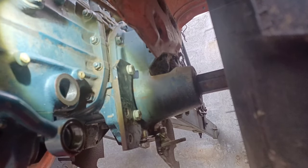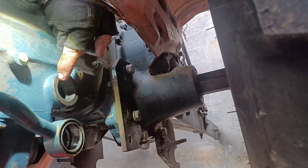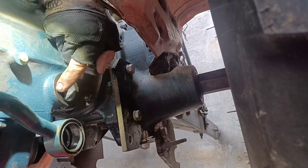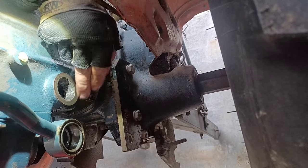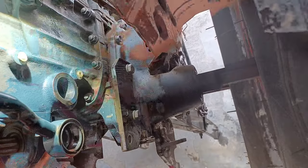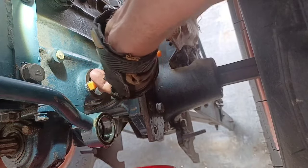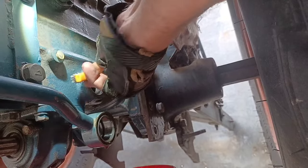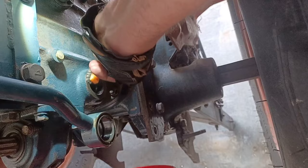Yep, I'm going to take something a little more harsh on that, I think, because that's got some corrosion on it where there's been a little more space than there should have been. Probably had some moisture in it. And that's probably a big part of why it was so hard to get off there. This is one of those parts that's not so fun because you don't want to leave this here, but you also don't want to introduce any more particulate into the hydraulic system. Got enough of that problem on our own.